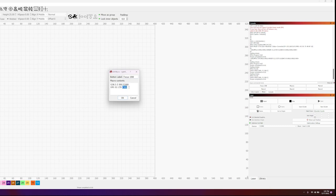The speed number is going to be different on each machine — if your machine is configured in millimeters per second versus millimeters per minute, the numbers will differ. Always start low and go up from there so nothing breaks. The retract distance after the material is reached can also vary — it could be 30, 20, 38, or 35 steps — this is per-case. Once you calibrate it you don't need to do it again unless you replace or change the material sensor. After that you're set to focus over anything you throw at your machine.